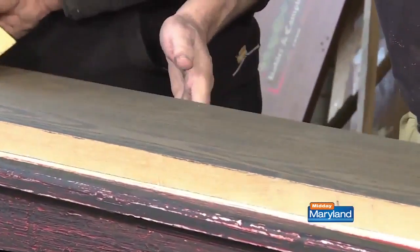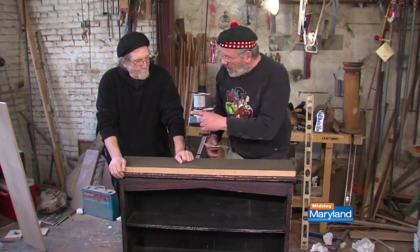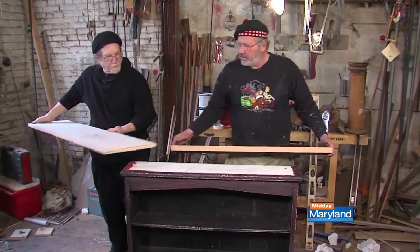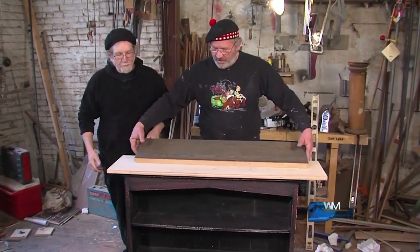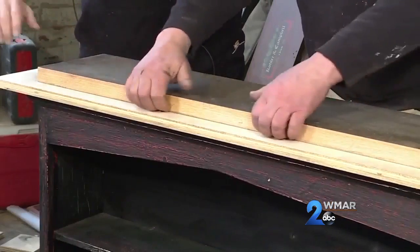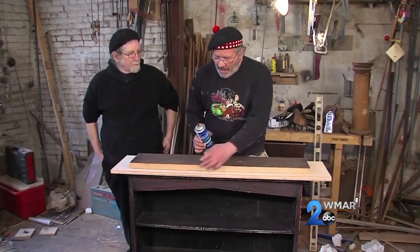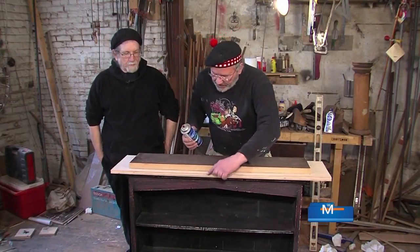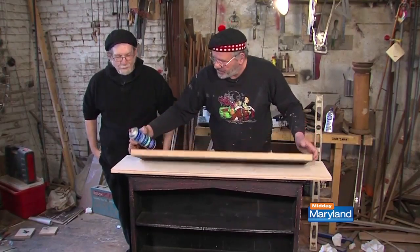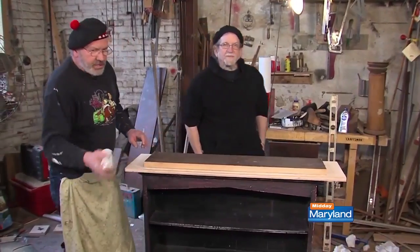I want to do another treatment with the edge — make that black too. So I devised a system: get that piece of plywood, lay it down, then place the piece face down so it's perfectly flat. I'm going to use an ebony black toner spray. By spraying it with a flat surface here — surface to surface — it won't bleed underneath and stain the piece. First, shake it up...